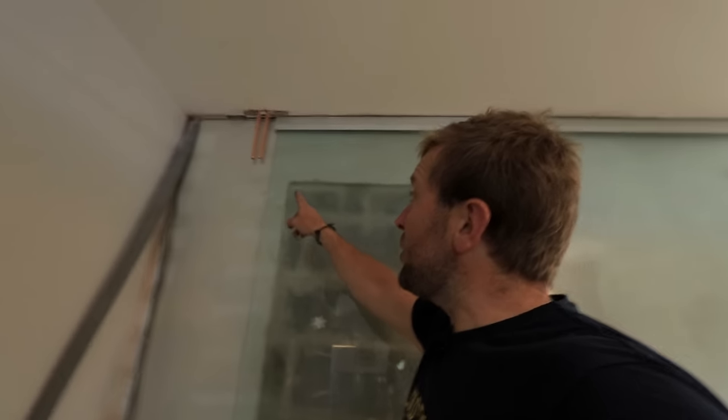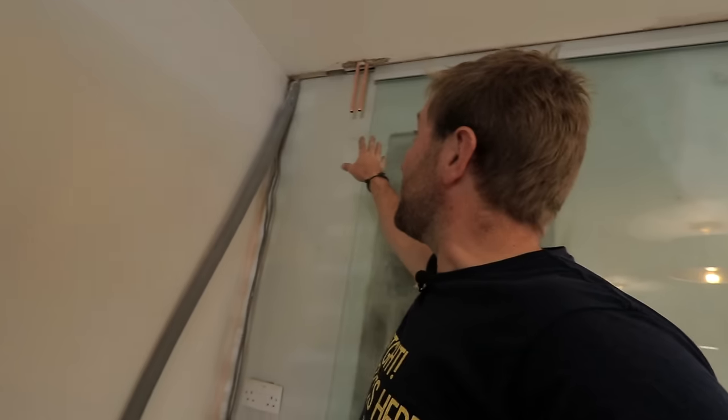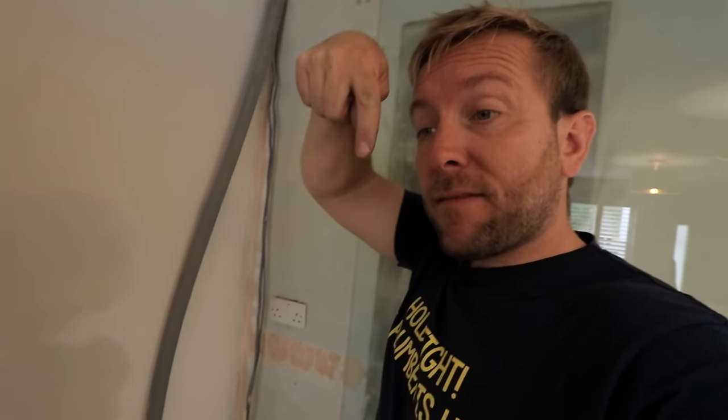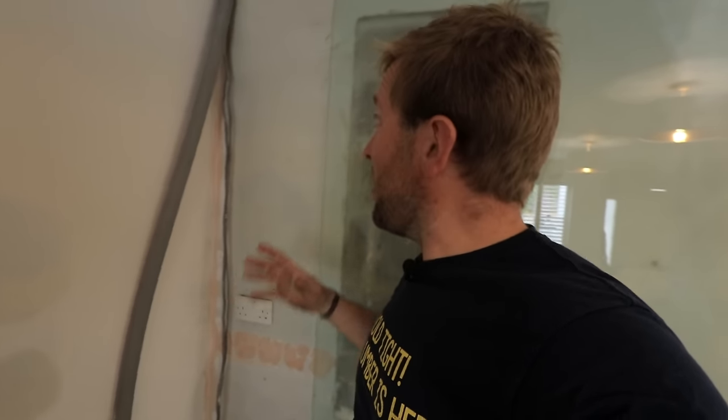So here are our two pipes up here now. Basically, our flow and return, all I need to do is pin them back to the wall, bring them down here, and then I just have a U with the feed pipe to the kitchen, the uncirculated bit, which I can use plastic on, sticking out of the bottom of that. So that's what I'm going to do now.